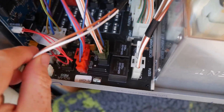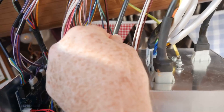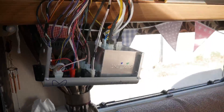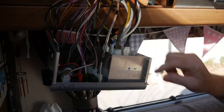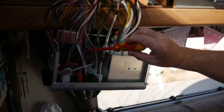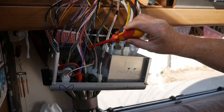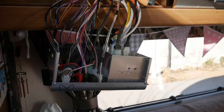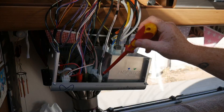There's a solar regulator circuit on the board connected through those cables. This cable here is the one that comes down from the solar panel. You've got this red and black wire here that connects into two points on the solar panel side of the solar regulator, and you've got these two little wires here that connect onto the battery side of the solar regulator.